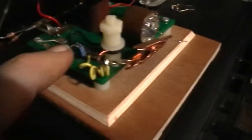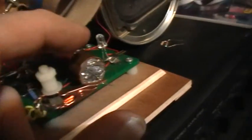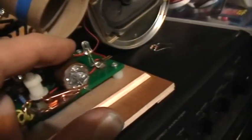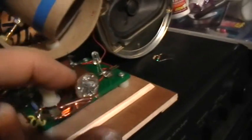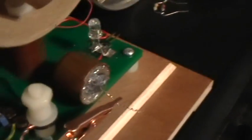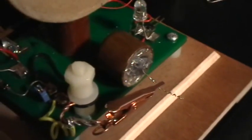I can either have the diode in, or I can take the jumper out and then use this lead galena crystal over here. That's a lead galena crystal embedded in a pot of solder in a little copper pipe fitting. The alligator clip has the cat's whisker, which is a piece of phosphor bronze wire that I got off of a broken guitar string.